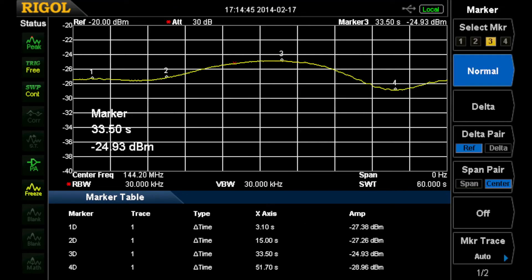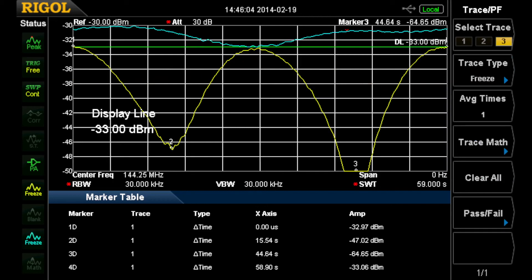I also rotated the omni-angle antenna and got about 4 dB overall variation around the circumference. Finally, comparing the rotation curves of the omni-angle and the broadband balun dipole at the same frequency, the omni-angle seems to have more gain — but I think that's because it doesn't have nulls off the sides, so it picks up reflections from those nearby wires. We'll try this again in the front yard where that's not a problem. But for the moment, since it's started raining again, we'll stop here and I'll let you know what happens.